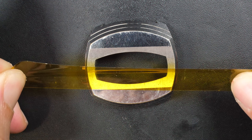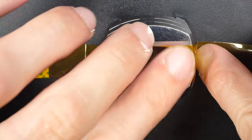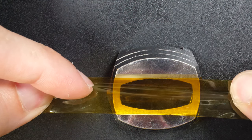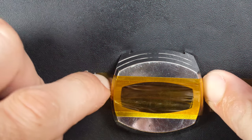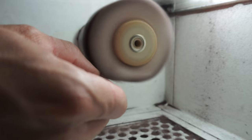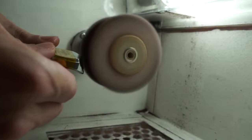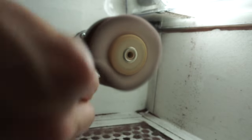Next I'm going to polish the crystal — the shape is very different, it's not a round crystal, so very tricky to find a replacement. I'm just going to polish it to make it very shiny. I'm also going to do a gentle polish on the case, but I want to keep the satin parts intact, so I'm going to protect them with some Kapton tape which resists polishing. Now polishing the crystal with a very light polish to remove all the scratches. Then a very light polish on the case as well since it's chrome-plated, just to make it a bit more shiny.